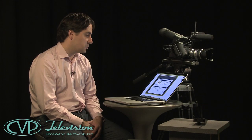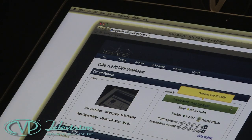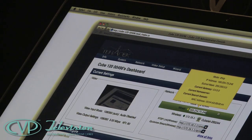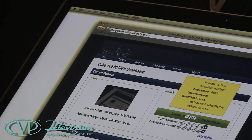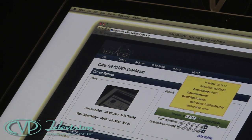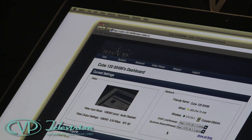The dashboard shows two connection settings — wired and wireless. We're not using wired today, though we could plug these into a network switch via Ethernet. The wired interface shows a yellow icon indicating it's inactive. The wireless interface has a green dot showing it's active and is using an ad hoc network, displaying the network name. Underneath, there are two links: one for the full-res stream and one for the quick view low-res stream.